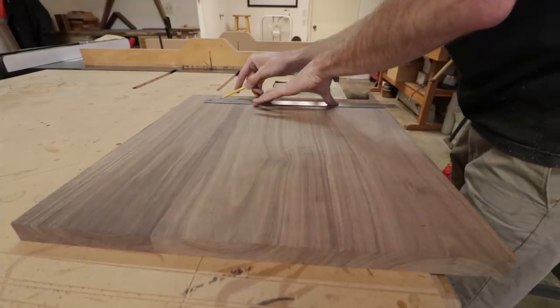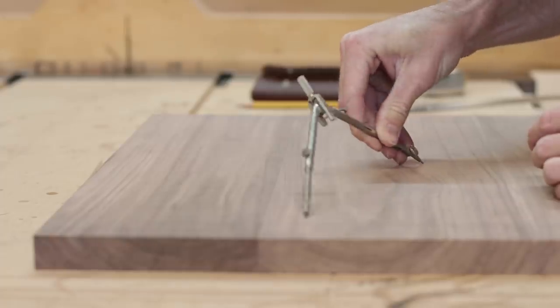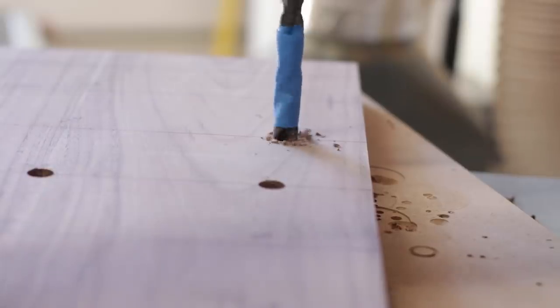The legs are pretty much ready to go, and now we get to the fun slash tedious slash dusty part: carving the seat bowl — the seat indent where your butt goes, the place where you sit. What I do is first mark the shape that I want, and then I'll drill holes throughout the seat area to specific depths, which give me an indication of how deep to actually carve in each part of the seat. For the actual carving I use a Kutzall carving wheel.